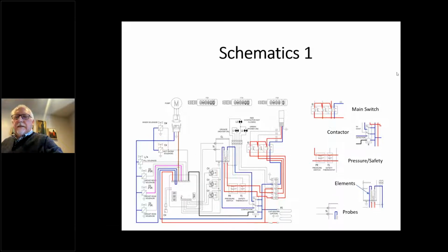Okay, so in terms of components on the machine, here we'll cover some of the basics. So what I was saying, getting back to where I was: within the system, the machine is basically divided between everything controlling the heating system and everything controlling the electronics, and they're typically separated out. And that's one of the reasons why you have main power switches that have 3 positions. Off, on with electronics, so that you can actually test the machine and see how things are working.